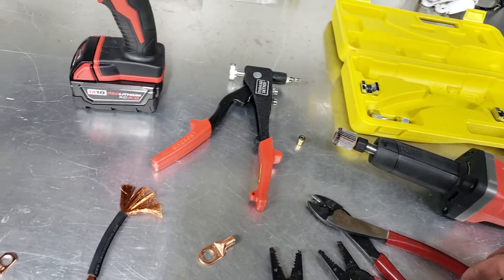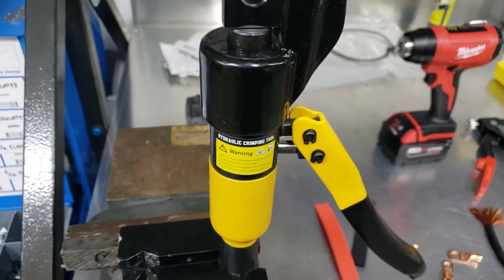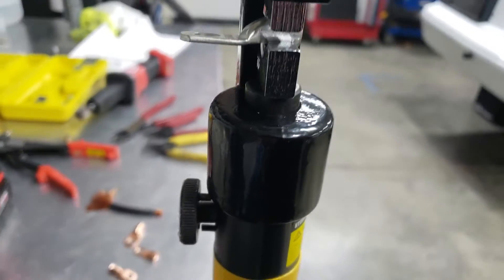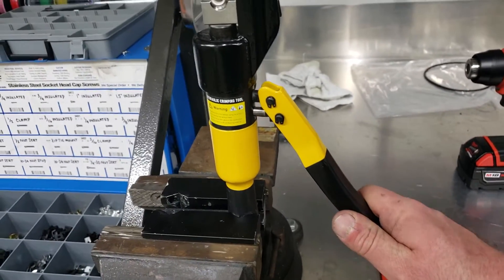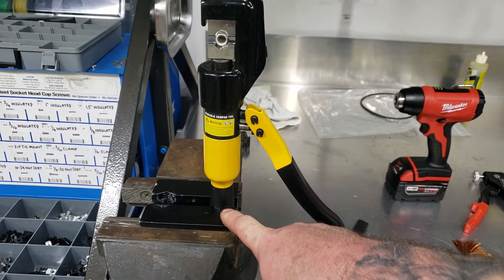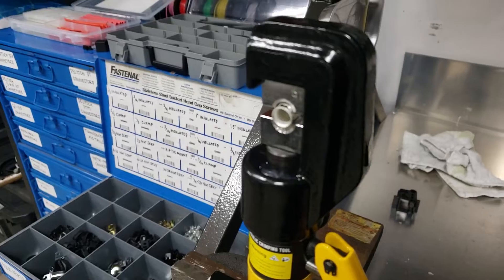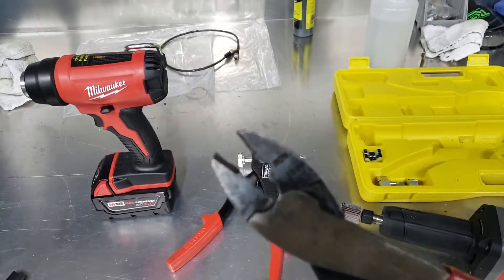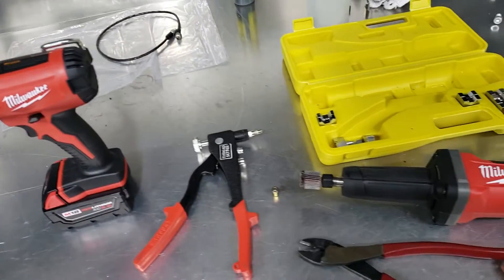I'm going to show you a couple tools. These are just regular lugs — they come in a couple different flavors. This thing right here is a hydraulic crimper. It was from Amazon, I think all of about 30 bucks — if you get on Amazon you'll find it. It makes life a lot easier. If you've got a pair of vice blocks, they work great to hold the handle. So if you work by yourself like I do, the vice actually comes in handy. That gives you a nice, good crimp instead of how most people do it — those hand crimpers are fine if you've got a strong hand, but some of y'all don't, so the wire comes ripping out of it.